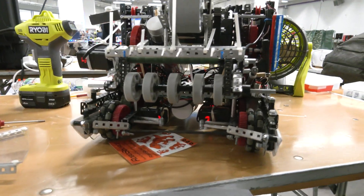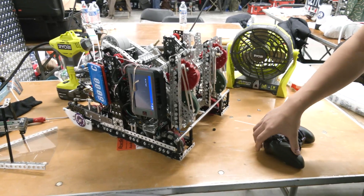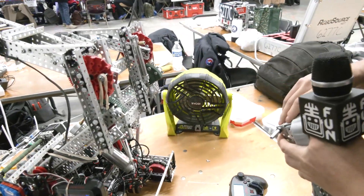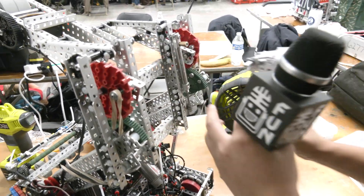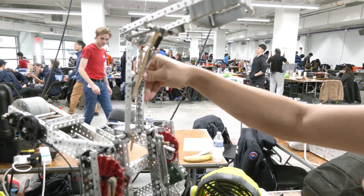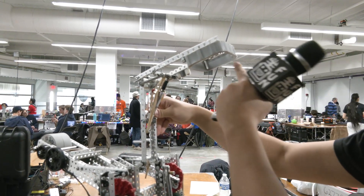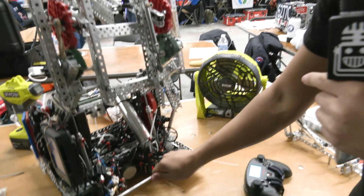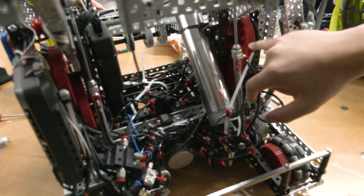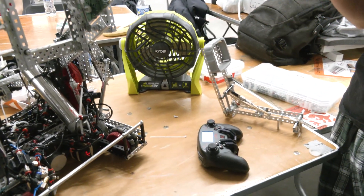As we wrap up, you had a big hang on your robot coming into the Wave but it's not on your robot currently. So we had an F-tier hang mech on the back of the robot. It actually folds up like this back here, and this piston releases it and it flips up. We can have this flex wheel go over the pole — there will be string attached on this flex wheel. We have two pistons inside the robot, the first one here and the second one here, which actually shift the gears out to the drivetrain motors and connect them to these winches on both sides. So this flex wheel self-tightens around the pole and we can actually winch ourselves up to F-tier.